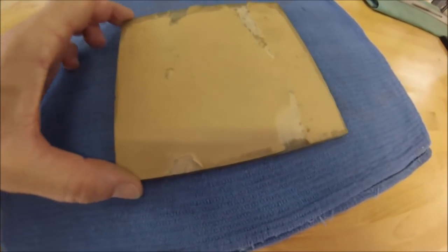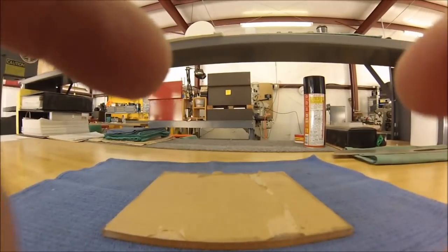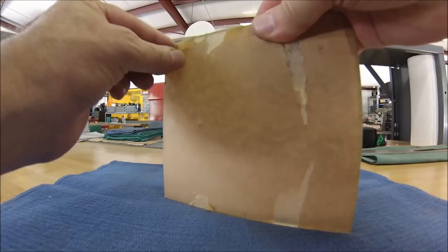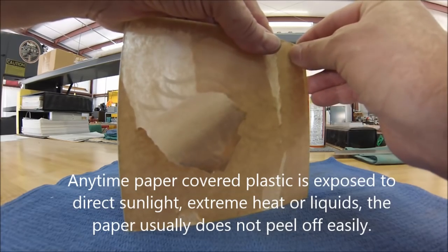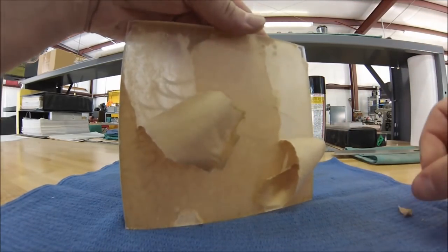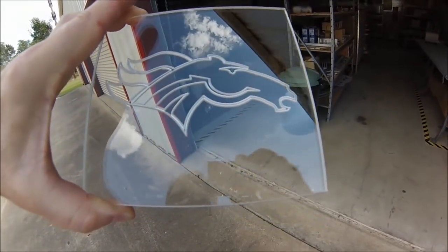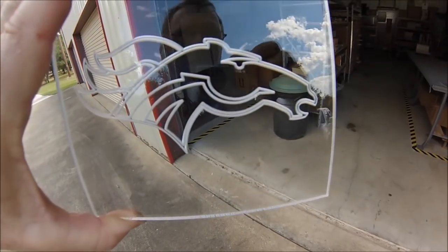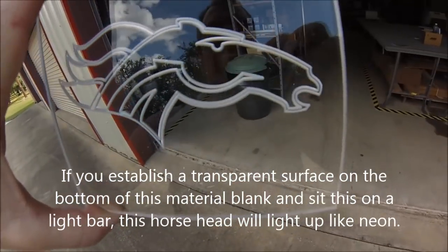This particular piece of plexiglass has quite an effect. I'm going to sit the camera down and peel it right in front of you so we can all get a good look at it together. The paper stuck a bit — I was hoping that wouldn't happen, but when the coolant gets to the paper it's not pretty. There it is — done from the back, about 30 thousandths of an inch deep. It is a double pass with a 90-degree cutter, quarter-inch plexi. Gives a great effect.